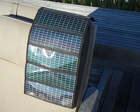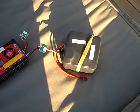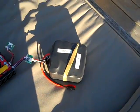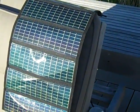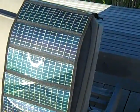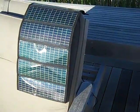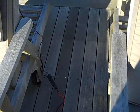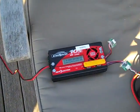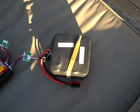Here's K2EFG. We are charging now at a slightly different angle. We have 14 volts coming in going into the bigger A123 battery. The solar panel can actually produce up to 15.4 volts, so I had to put part of it in the shade, and I'm now getting 14.1 volts. I have five panels exposed to the western sun, connected to the CellPro 10S charger and the A123 battery.